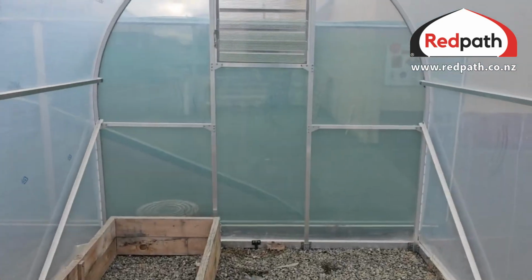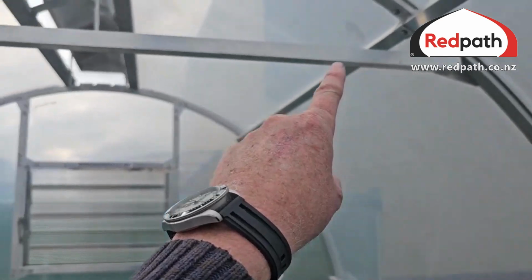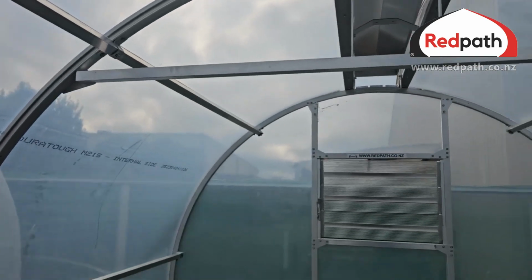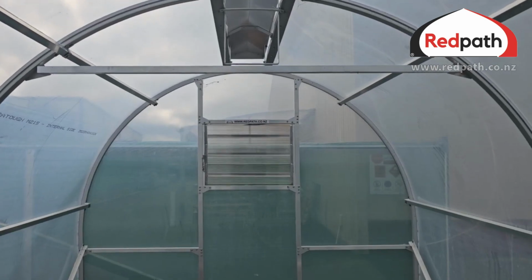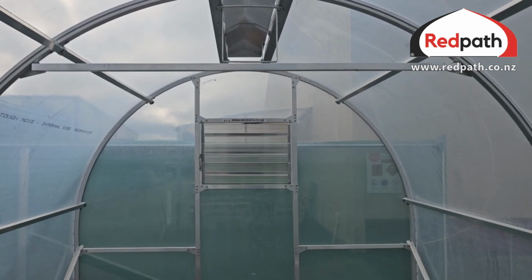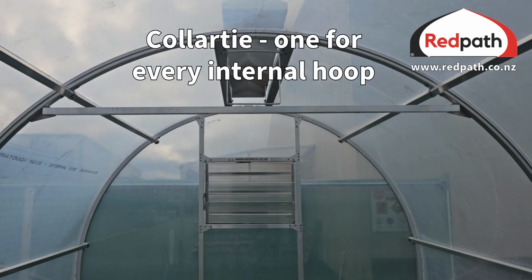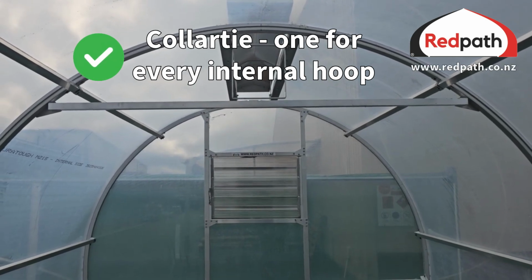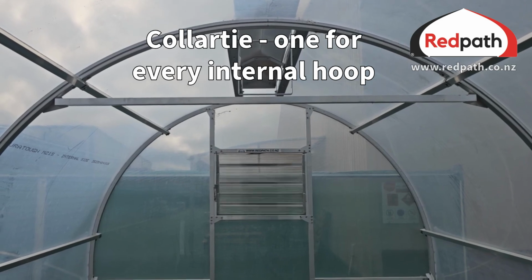Here we are. So the first part of a high wind kit is the collar tie. This is a collar tie that goes across the internal hoop of every hoop. So in a 3 metre it's only just the one because there's only one in the centre. On a 4.5 there would be two, on a 6 metre there would be three, and so on, right up to the 24 metre length option building. So the collar tie brace goes across, and that stabilises the hoop in side load winds, and helps with those extreme conditions when they occur.